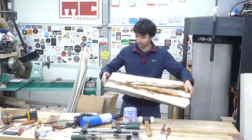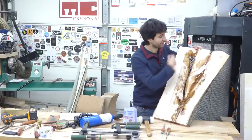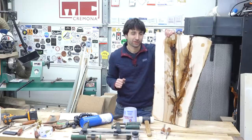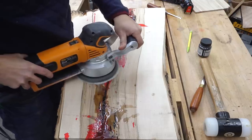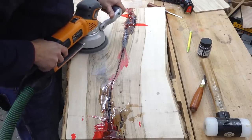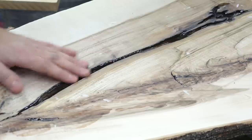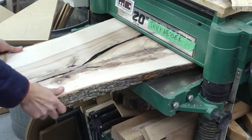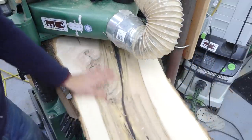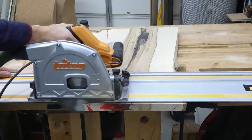That's looking all ready to go from here, so it's time to do a little cleanup work. This does fit through my planer — it's only 18 inches wide. I'm not sure why I was originally using a router sled, but maybe that was from when I had a 15-inch planer. It's still flat, so I'll just use a sander to remove the excess epoxy on the bottom side, get it all cleaned up so there are no globs throwing off the flatness registration. Then I'll use the planer to clean up the other side, get rid of the excess epoxy and flush it all up. The epoxy does shrink a little bit as it cures, so the planer will flush it up with the wood. I can also trim up the ends with the track saw again.